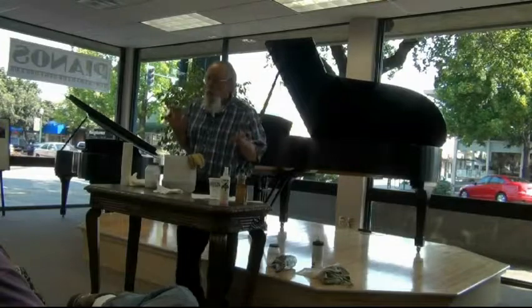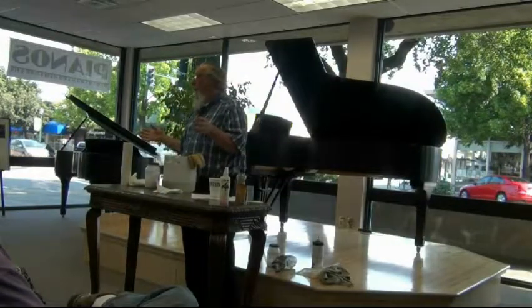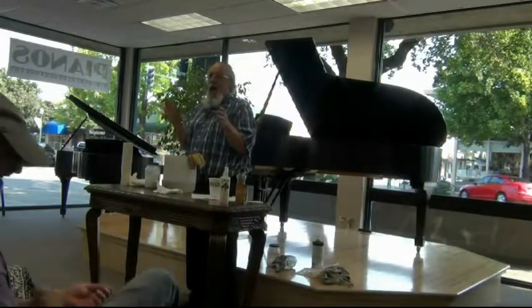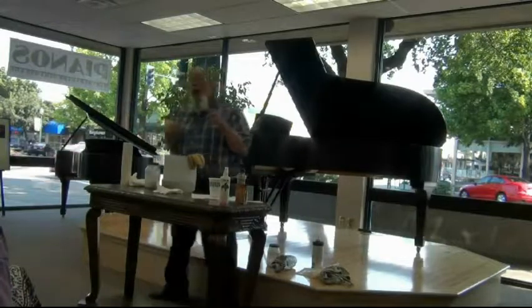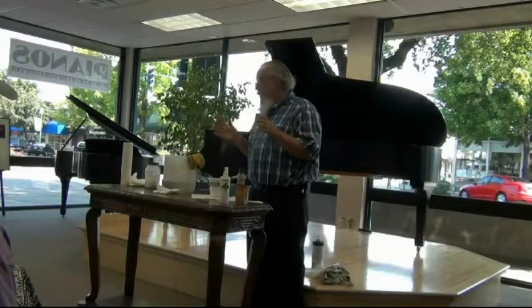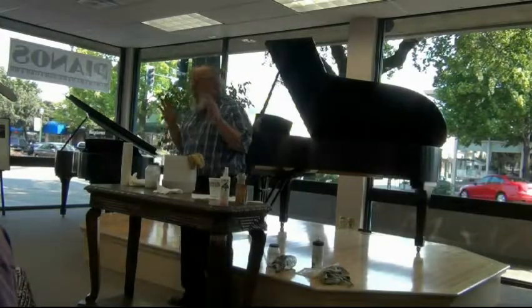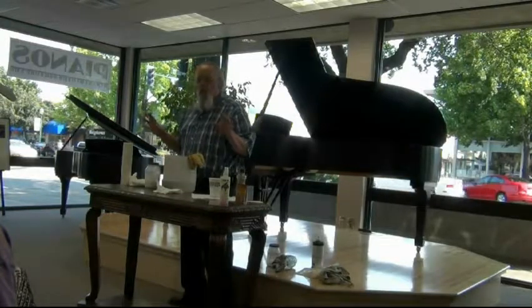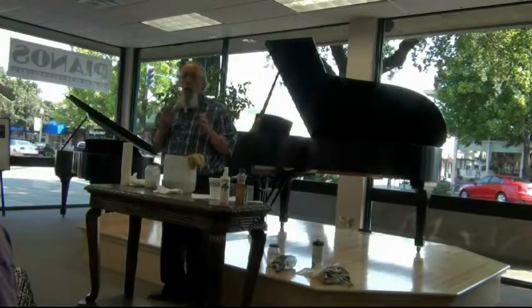Which brings us to another subject, and probably my main campaign and reason for doing a class like this, which is to tell everybody to please not use Pledge. Does anybody use Pledge on their piano? No, nobody. Well, you're all great then. But I'm going to tell you why you don't want to use it. Pledge is a product that's been out since the 50s. In a spray can, you put it on the top and you wipe it off, and it's beautiful. It gives it a nice glossy luster, a fabulous look. But Pledge is full of silicone, and the silicone is what makes it glossy looking.